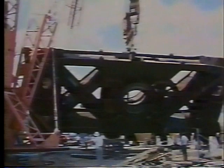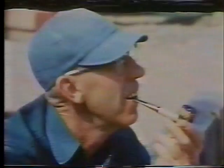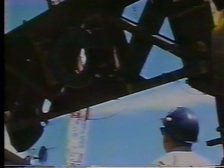This was the first of the four sub-assemblies which in the air would become the yoke. The first to go up is the center piece, which fits on the sphere. Other sub-assemblies were moved back, and the center with hub was raised off the ground. Here again the angle of the piece was all-important — it must hang so that the hub is at the angle of the sphere to which it will bolt, in the same way the sphere bolted to the shaft. Every man on the site was involved one way or another. The yoke center was the heaviest lift made; a single pick point was used with a balance beam to equalize the 460-ton load between the derricks.